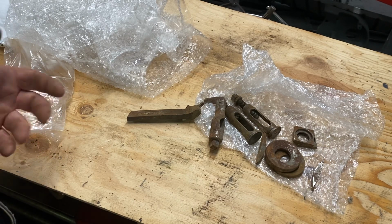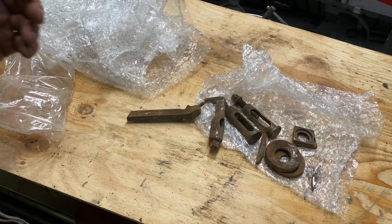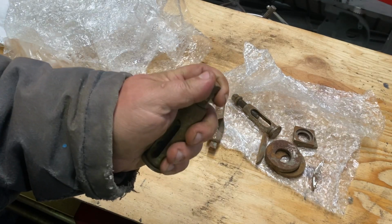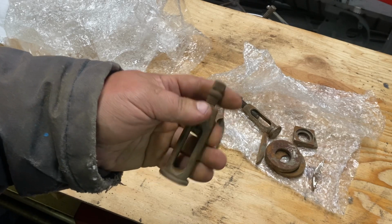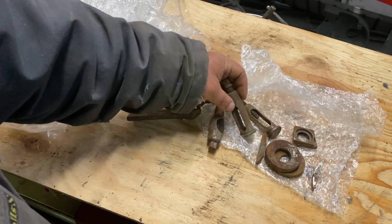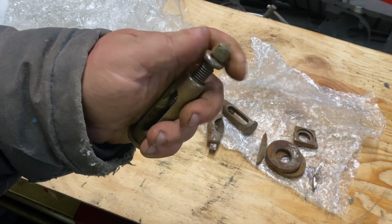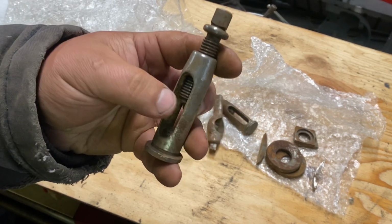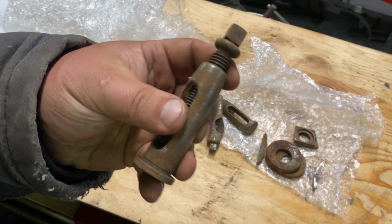Because you're not really taking advantage of the tool pressure and stuff that carbide likes. And, you know, one of the first things when I started machining, I learned how to grind high-speed steel, because then I always had the tools or could make the tools I needed. So don't shy away from it. Spend the weekend grinding some tool bits, and if you have a smaller lathe, you'll be surprised. Even bigger lathes, I use them for all my interrupted cuts, always high-speed steel.